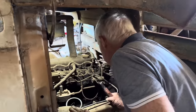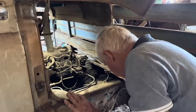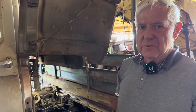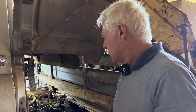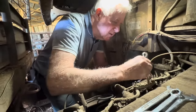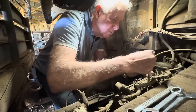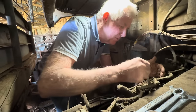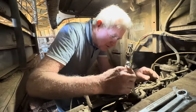I think I'll go ahead and crack the lines out at the injectors, just to see if I can get rid of that old diesel before we get too serious. It must have a pretty bad positive lead going from the main battery up to the starter motor. I've just hooked up a second battery because I reckon the main positive battery lead might be pretty cooked — so I've got a second battery outside on the ground with another set of jumper leads coming off it. Once I did that I could get some sense out of the starter motor cranking the engine. Every engine always has a couple of awkward ones to get at — if you can put a spanner on them then you can't turn them, but that's all part of the challenge.